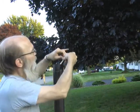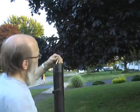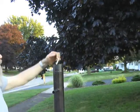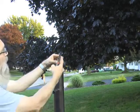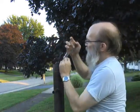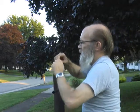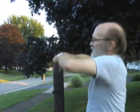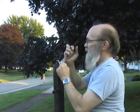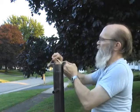All right. Now after setting the knife down, pull the ground conductor out of here, and okay, with the diagonal cutters, we're going to nibble down through the center of this, being careful not to damage either the hot or the neutral wires. Basically, I get in line here with the center. There we go. Now I can peel it. Because if this was not old cable, I wouldn't be able to do this, pull it by hand. I'd have to actually cut. Okay. Now we've got a good separation between our conductors.